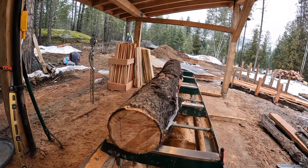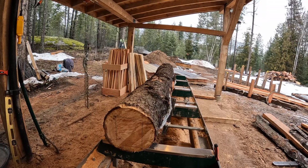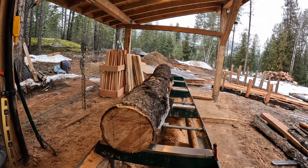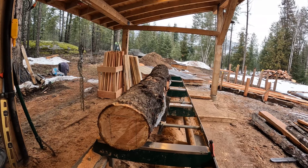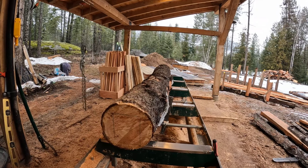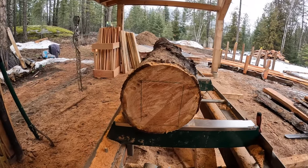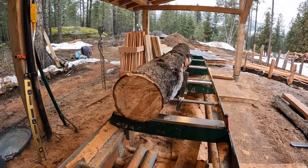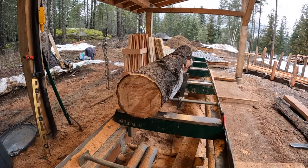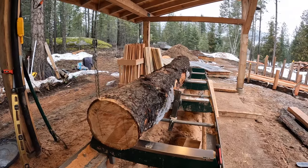It's a crooked log, so I probably will cut it until I get my 6 inches. Then flip it, because it may need some babying to get to that 6x8 mark. Not necessarily will I be able to stick to that grid there, but I like drawing it out, as I like to have the references of where I'm going and what I'm doing. You can always adjust it as you're going along.